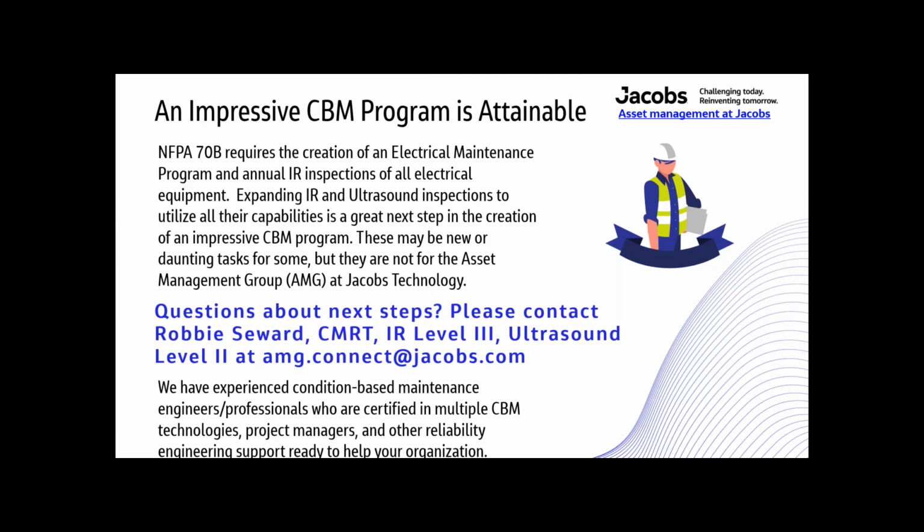So an impressive CBM program is attainable. NFPA 70B requires the creation of an electrical maintenance program and annual infrared inspections of all electrical equipment. Expanding infrared and ultrasound inspections to utilize all their capabilities is a great next step in the creation of an impressive CBM program. So these may be new or daunting tasks to some. They're not for the asset management group at Jacobs.